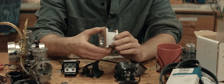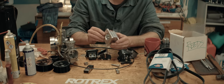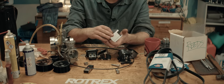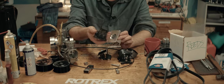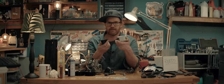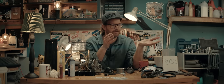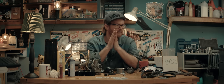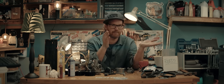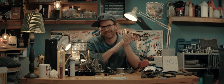I'm running low on aluminium stock, so machining something from scratch would be difficult. Then I found this thing, which is the adapter between the PIP engine and the roots blower, that AMR300. And there's enough meat here to fit the reed valve inside of this enclosure. This is nowhere near ideal, but for testing purposes, to see how the porting and the pipe and everything behaves, see if there's something fundamentally wrong with my cylinder design, pipe design, everything. I know there's people out there smiling.